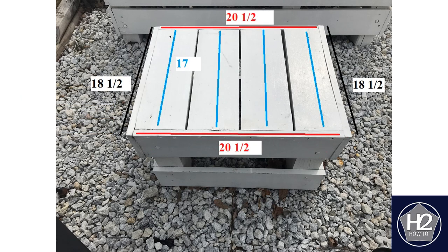In the next slide we see the dimensions. Looking at this top image, we can see the screw right here that was used to go into the top of the post — there's one here and an additional one here. We're looking at 18 and a half on this side, then 20 and a half. What you want to notice is that this top piece — this side is here, and then this piece right here is actually on the inside, and the outside is this piece right here. The front and back are placed on the inside of the side, and the screws are going in this particular direction.